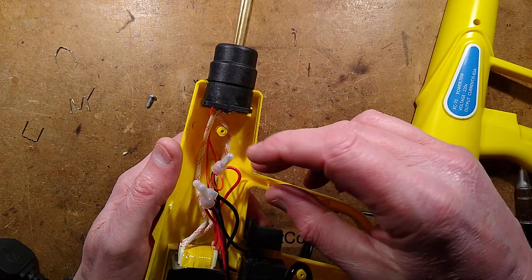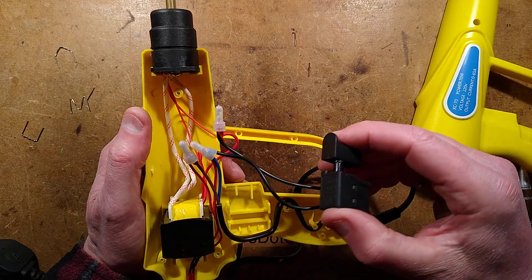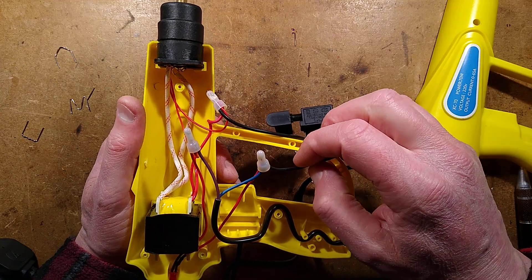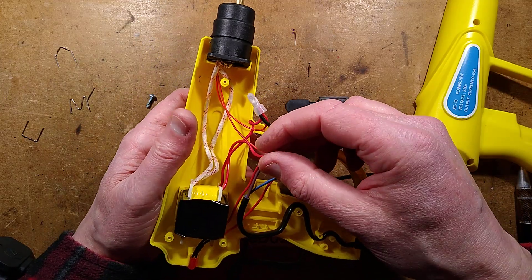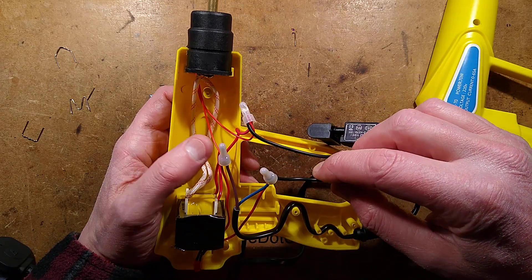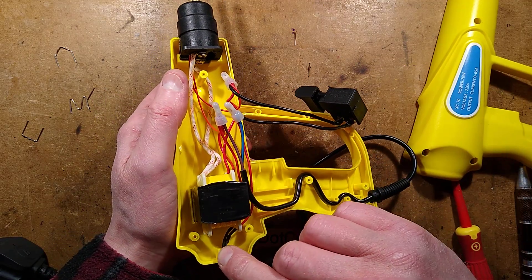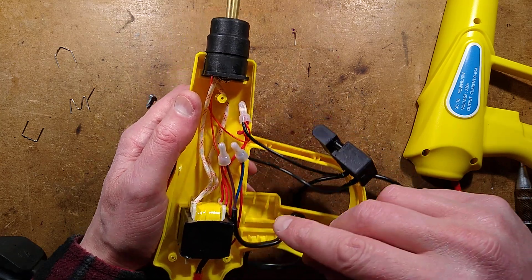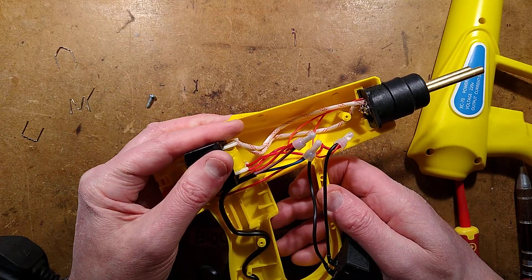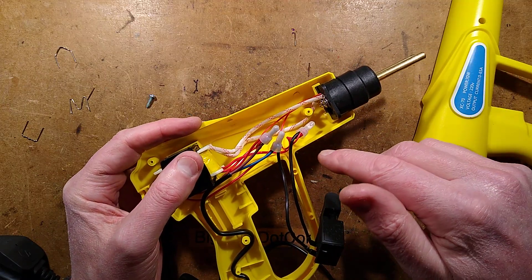Here's the incoming supply. There's the little trigger. The trigger does two or three things. This one goes out to the red LED and comes back — there's a resistor built into the red LED. And then likewise, the switch side goes out to the transformer. This one's just permanently illuminated — it's just a resistor in series. Tell you what, I shall draw the schematic, not that it's going to be terribly exciting. The transformer isn't very hot for those sort of high current moments it had. I can also clamp this and we can see what current it's drawing.